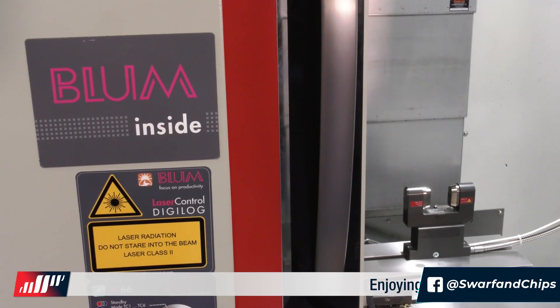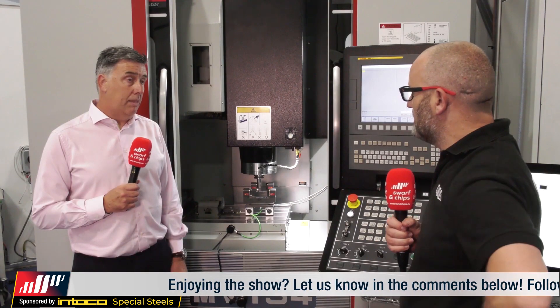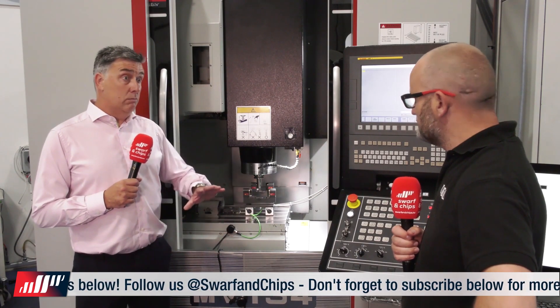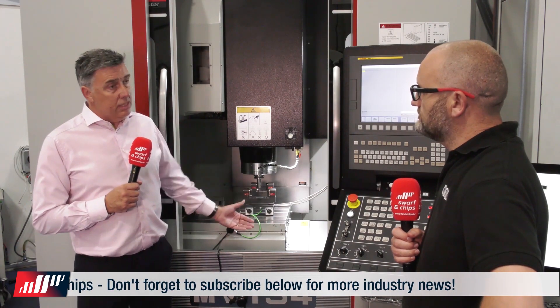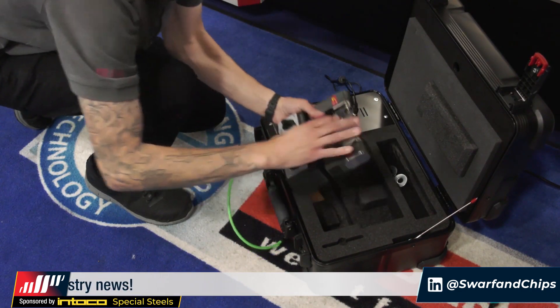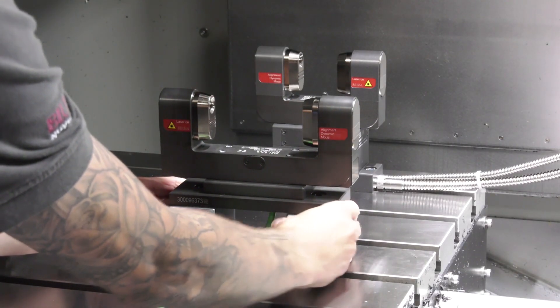So just how does that look? What are we trying to look at — are we looking to predict a breakage? Are we seeing that the spindle is 10, 20, 50 percent worn? Yeah, exactly that. For a production or machining company, if the spindle starts to fail and then dies pretty quickly, the machine's stopped and you've lost all your production. This is a means of being able to periodically inspect the spindle so you can see its status and detect very early signs that it is showing signs of wear.